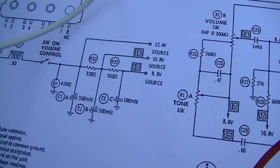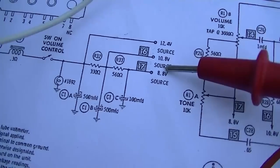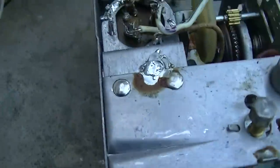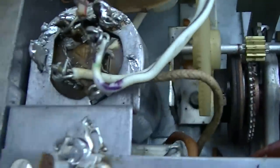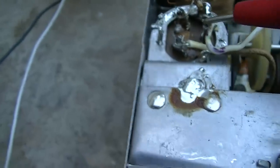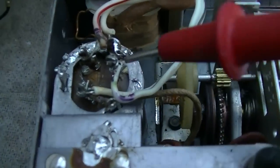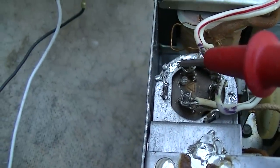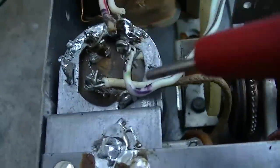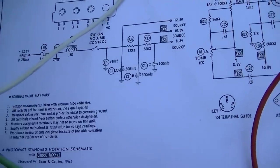Readings: 12.4V, 10-point-something on triangle, 10.4V on square, 12.4V, and 8.8V on the unmarked one. Now if I hook this back up correctly — here's the one with nothing: zero volts. Here is triangle and we have zero volts there. Here is square and we have 11.5 volts on square, and square was supposed to be 12.4V.